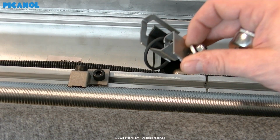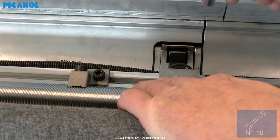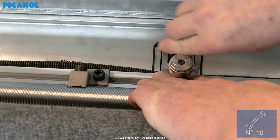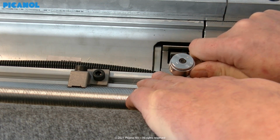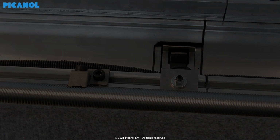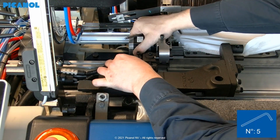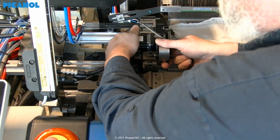Place the clamps on the relay nozzle air tanks. Divide the clamps evenly over the width. If you remove the temple support, it will be easier to mount the clamps and LED light bar. Remove the filling cutter and temple support.